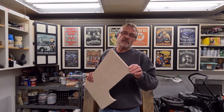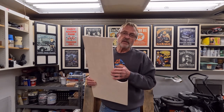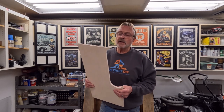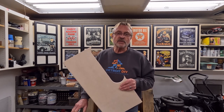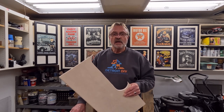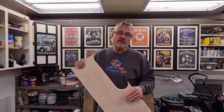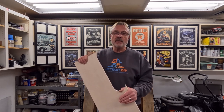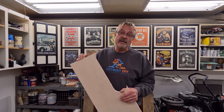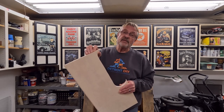The material I'm going to be using is Luan — this is 3/16ths. This was a two-foot by two-foot sheet and I've already cut one throat plate out of it. We made a zero clearance throat plate last week, and I'll put a link to it at the end. I also have table saw tutorials that if you're new to a table saw, or even if you've been using one a long time and become complacent, it wouldn't hurt to watch. I became complacent and almost lost the end of my finger. So this is 3/16ths Luan and I've cut it in half and glued it together.